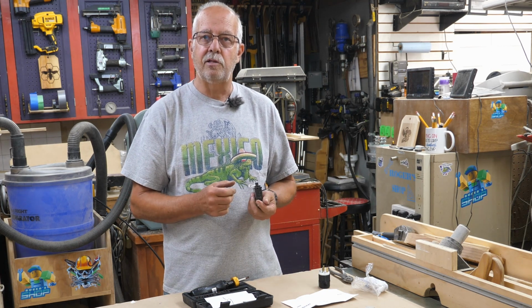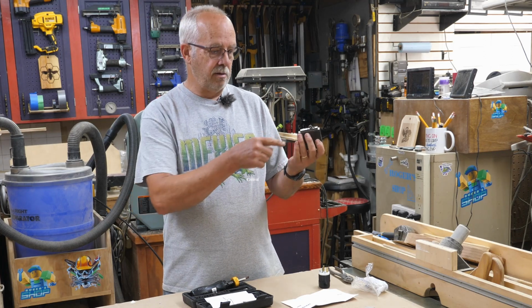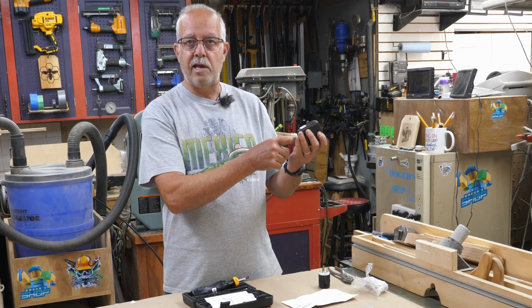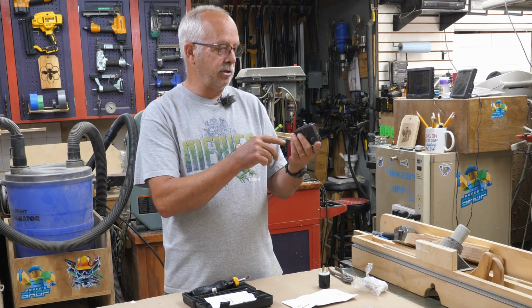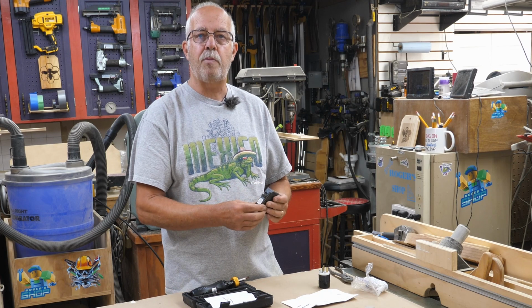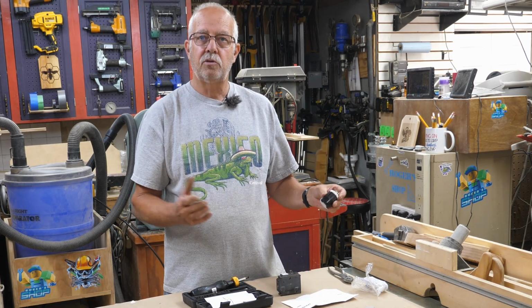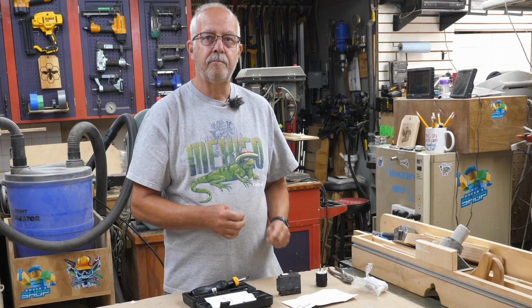Something that is now written in the National Electrical Code is you have to adhere to that specification. So you need to be able to, like this here, needs to be torqued to 36 inch-pounds. I looked this up already on the cord cap, 12 to 14 inch-pounds.